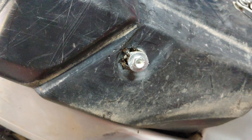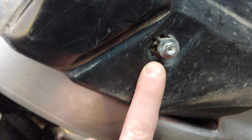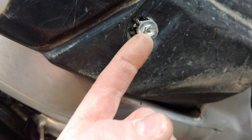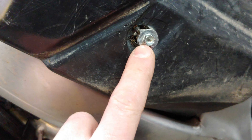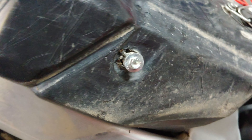I've done it before and I had a video where I had a perfect amount of detail and walked you guys all the way through it, but somehow it got deleted. Either way, we're gonna go ahead and fix this thing. First we're gonna cut around the outside, pop this thing out, get this bolt out of here, make sure the threads are good, clean everything up, and then we're gonna use some two-part epoxy on the outside of this nut and on the inside to get in all the crevices. Then we'll shove it back in, smear some on the outside, let it set, clean it up, and it'll be good as new.